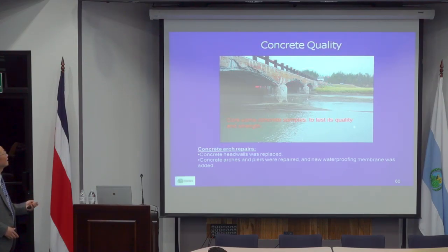But we put a perforated drainage pipe inside and let it go out, so when the water does go in, it can get out. Later we did much the same thing, provided granular material, and paved back. So it looked the same as before.